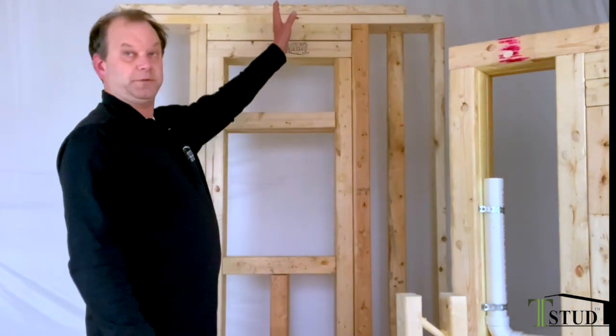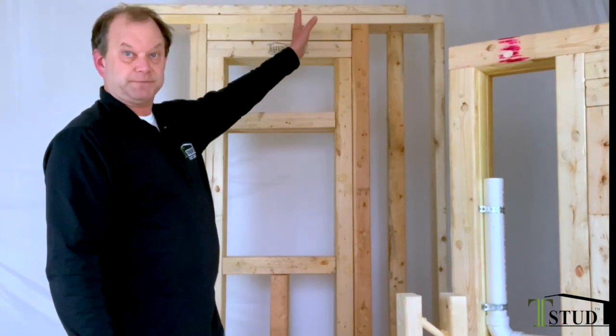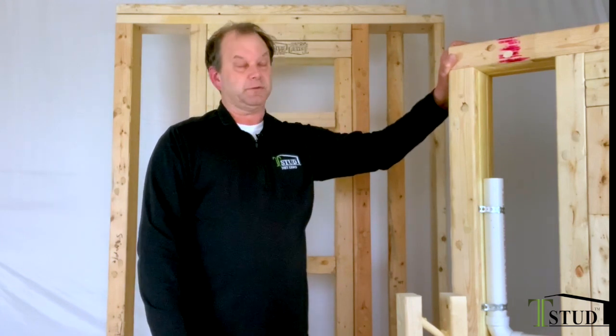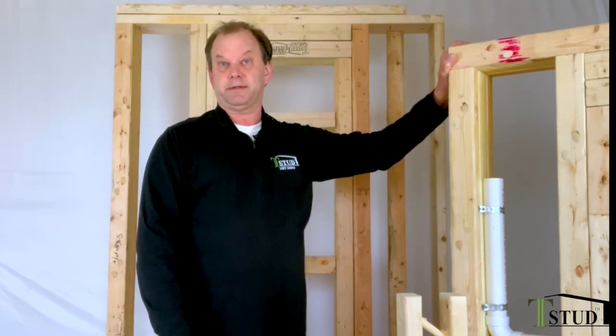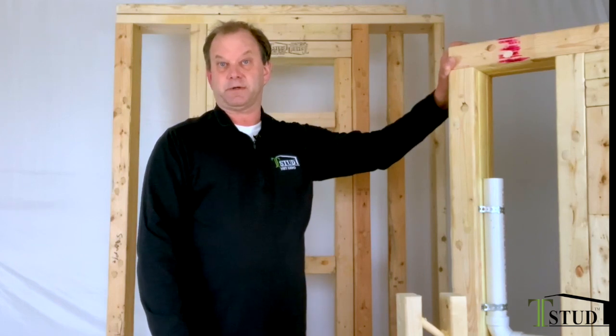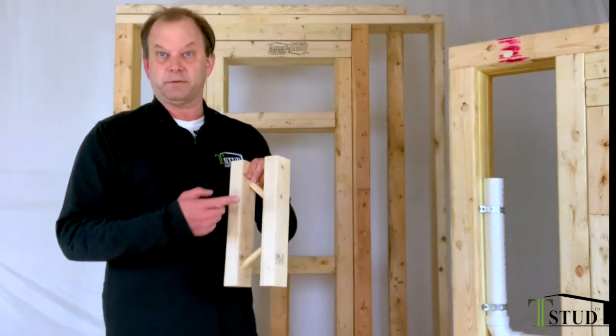Framing — there are two different ways to do this. Two by six top plate and bottom plate, standard — that's easily done — or you can use a T-Stud for the top and bottom plate. It kind of depends on what your client wants. Money is a factor, return on investment is a factor. And if you're LEED certified, trying to go for a score, or if you're a passive house or net zero kind of person, the T-Stud finishes out the entire story and you get a complete thermal break through the whole entire assembly — obviously except for where the dowels come across.